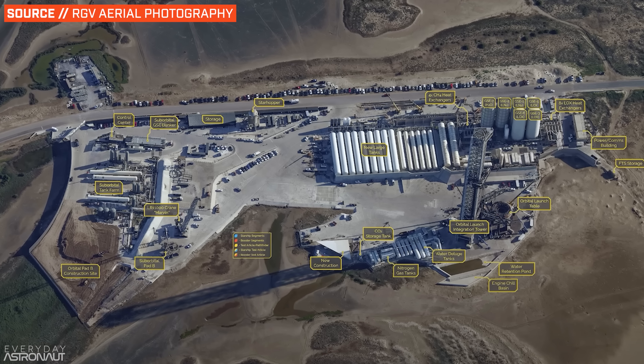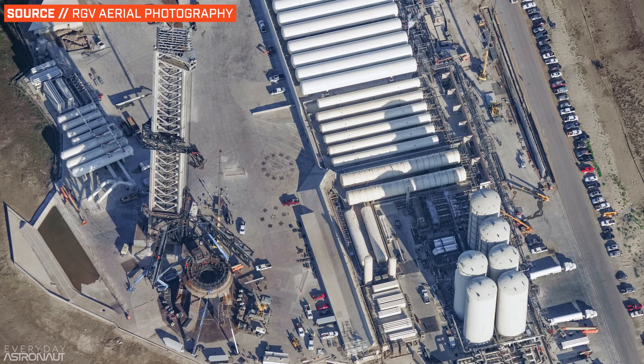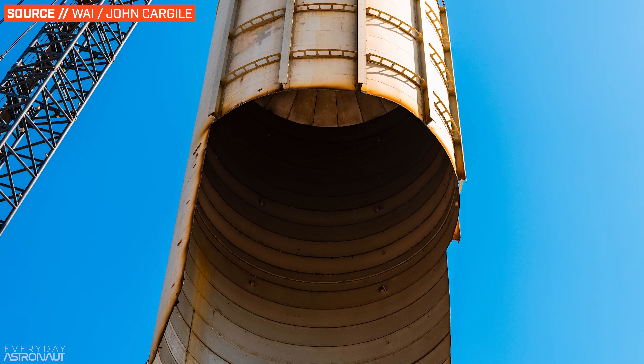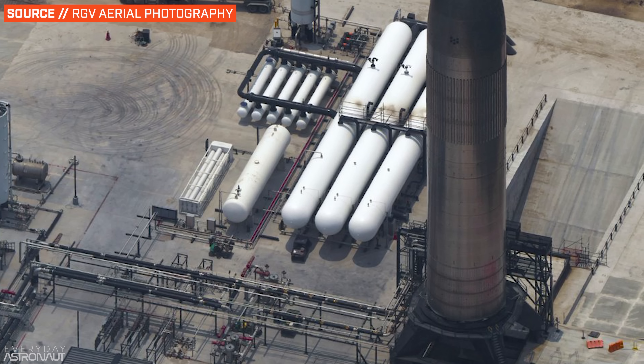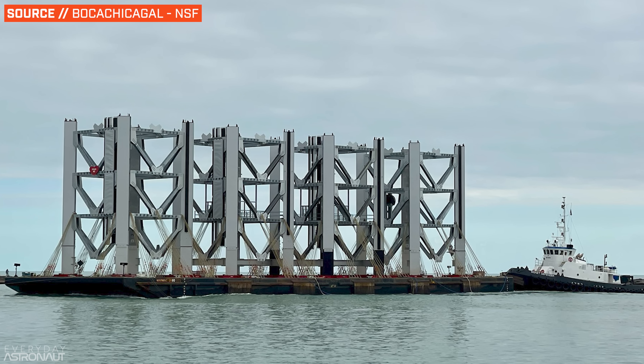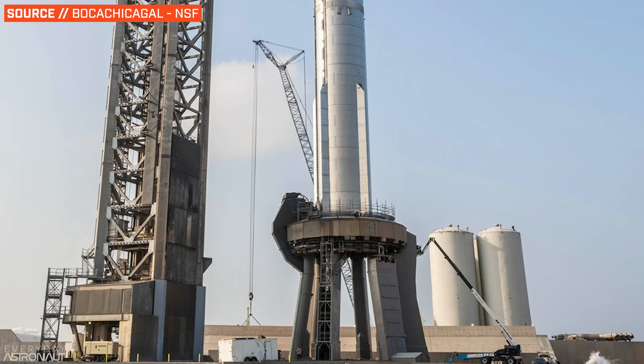Let's start off with the launch pad. Since Starship's third flight, we've seen SpaceX continually upgrading and maturing the launch pad. Most notably, the biggest horizontal tanks in the tank farms are now online and supplement the old vertical tanks that are being retired and continually torn down. These tanks likely won't decrease prop load times, but they will help continue the expansion of storage, which will help with recycling times and reduce times between launches. The last of those two old suborbital launch pads has been decommissioned, with ship test operations now happening at the other test site, Massey's — to help make room for the second orbital launch tower. Another upgrade is with the quick disconnect for the ship, which likely features some upgrades to help increase reliability and decrease refurbishment time. And lastly, there's a fresh coat of paint all over the launch pad.